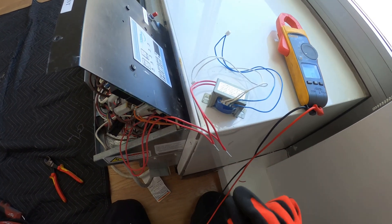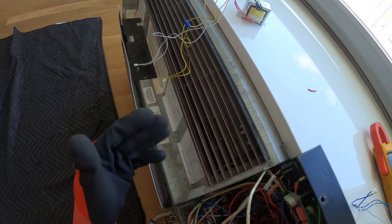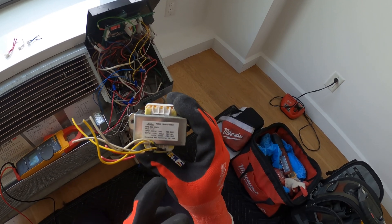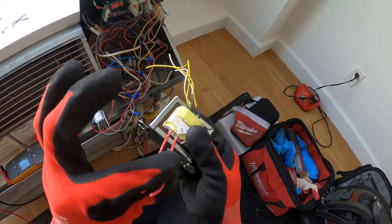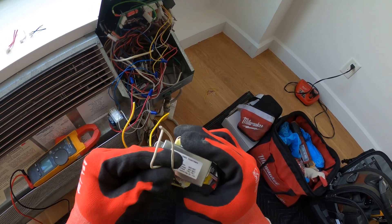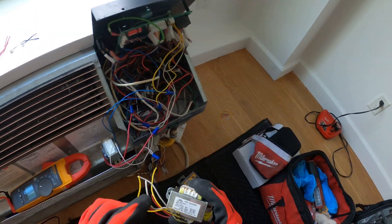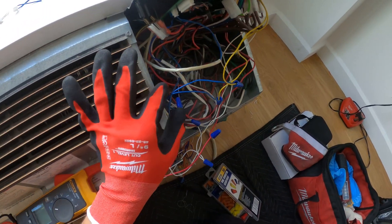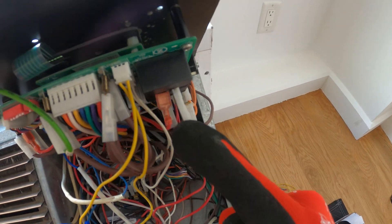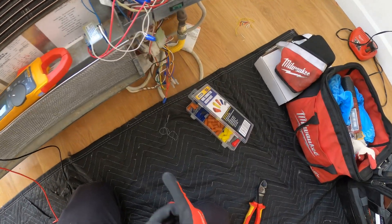What I'm going to do is wire this in. I'm going to use this piece to connect into the board and splice them accordingly. Here's the old transformer — the color coding is the same except for the 24 volts. Our 208 input is the two red wires, same thing for these two. Then the 11 volts is white — this is actually 12 volts but it's no big deal — so white to white. But the 24 volts on this transformer was yellow, while on the new transformer it's blue. So I put the two blue wires to the two yellow. I reused the connections at the board because these don't fit since it's for a different unit. We're going to plug it in and see what happens.